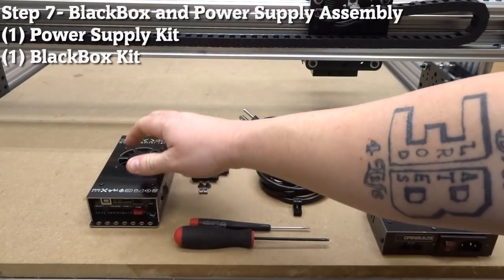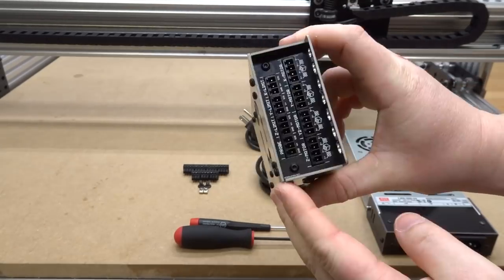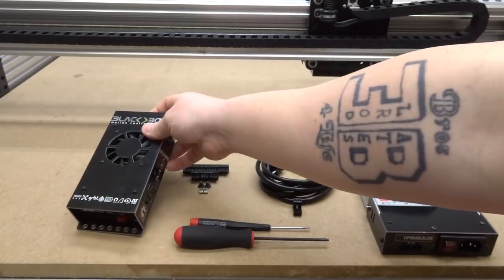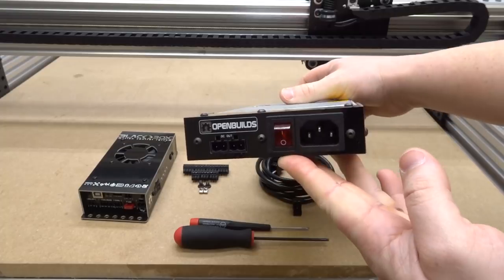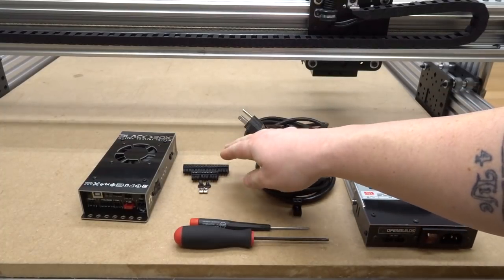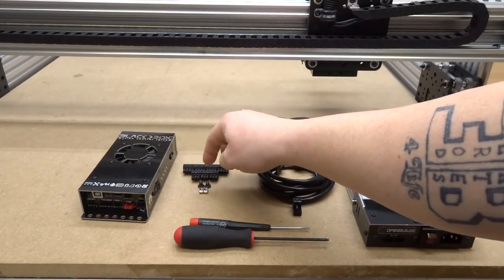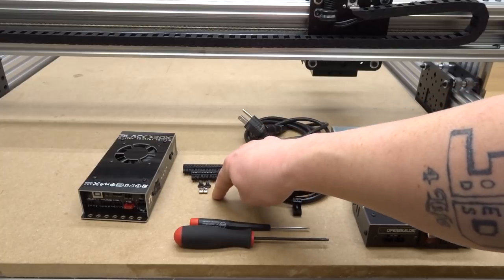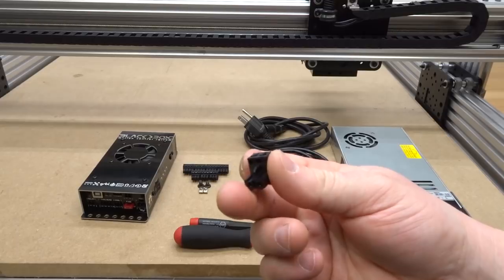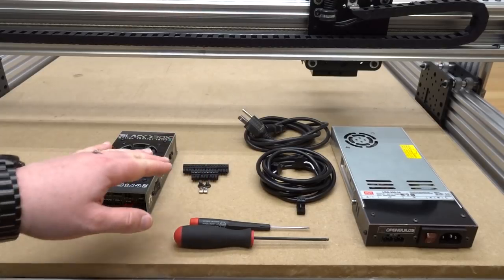On this next step we're wiring up the black box controller — it's super exciting and super easy, a plug-and-play system. There's an additional video linked in the description for assembling the black box and power case kit. We need four-pin male connectors, three three-conductor male connectors, two M5 6mm screws, two drop-in T-nuts, the power cable and power wire, and the two-pin male connector for the power supply. Let's start by connecting our motor wires to the four-pin male connectors.